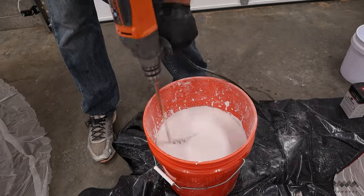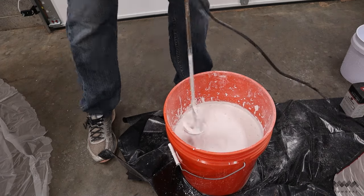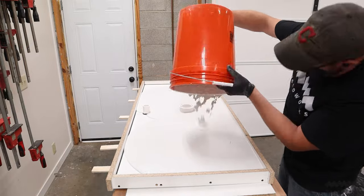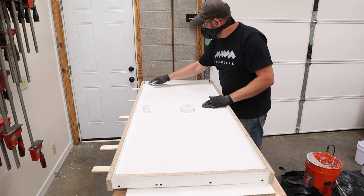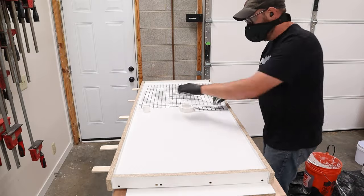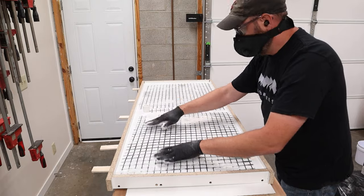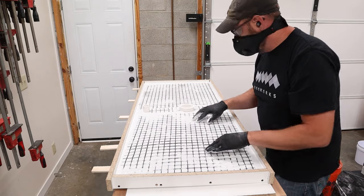When I get everything incorporated, it's a smooth, batter-like consistency. I pour it into the mold — see how easily that flows — and gently work everything into the corners. At this point I also add some fiber mesh reinforcement. This vanity is going to be over 50 inches long and only one and a quarter inches thick, so the extra help from the fiber mesh will hopefully keep everything from breaking during install and over time. Then I added a second bag of concrete over the mesh.